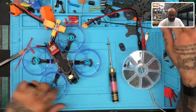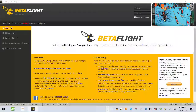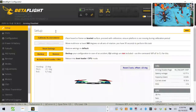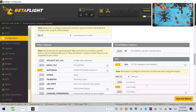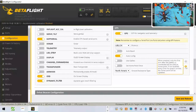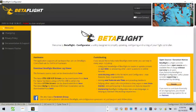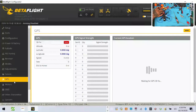So we're up and running. Let's plug in our USB and connect. Go to the Configuration page, let's go to GPS, turn it on. I believe we're using U-blox — I'll do auto-detect. Let's do auto-baud. Save. So let's go see our GPS now and see if we're going to get anything in here. We are indoors, but our power is running on it — I just need to see if we've got the right selection.